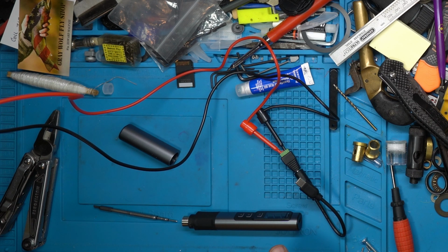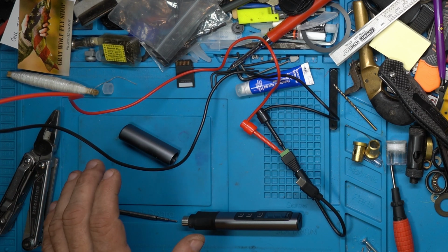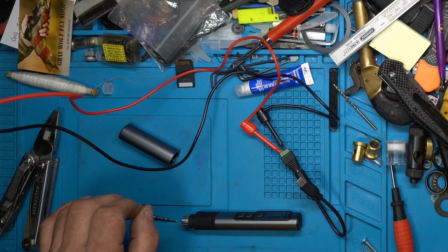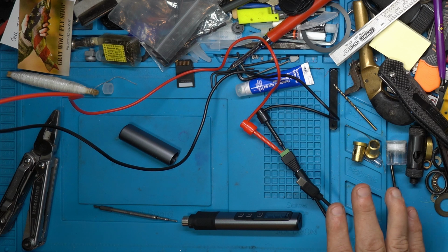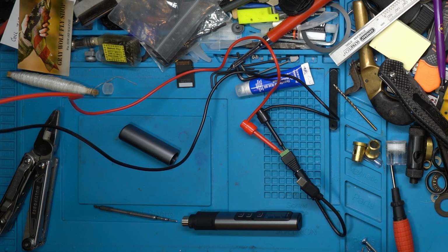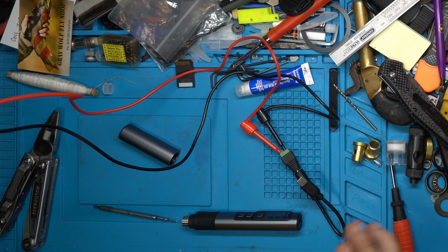So if you have 3 amps or more that your power supply will actually provide, it will work. And that's the thing about getting the Chinese overseas power supplies. Some of them are great, some of them are not. Some of them are rated at 3 amps, but they're not actually putting out 3 amps. The one I use on my bench all the time is rated for 3 amps at 20 volts. It's rated for 5 amps at 28 volts, but at 20 volts, it's rated for 3 amps. And for all the voltages from 19 volts down, it's rated for 5 amps, but just at 20 volts, it's rated for 3. And it's not supplying that. So I really don't think it's supplying even 5 amps at any of the other voltages. And the way it's tripping out is right there at it. So I would say, because my power supply is set at 2.95 and it was running 2.9